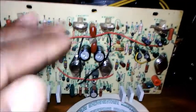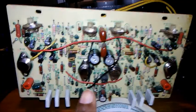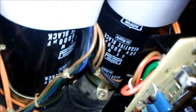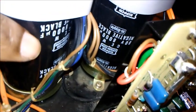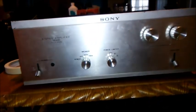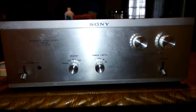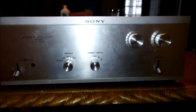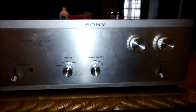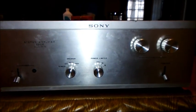Even though all four resistors are good, all four power transistors are good, and the driver transistors are good, it still sounds very distorted — like the moment you turn it up, it distorts immediately and won't let the voltage swing get bigger. This is the preamp board and this is the power amplifier section. The power supply is on this side, and you've got the large 8,000 microfarad, 80-volt caps wired in series. It powers up but sounds very distorted. It's got to be something on the preamp.